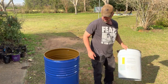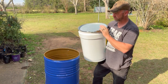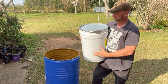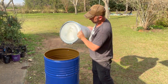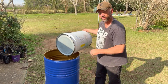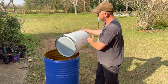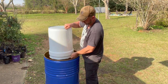When we put the inner bucket full of wood down inside the retort, we need a way for the gases to escape. We're going to drill some holes in the lid of the inner bucket so it off-gases out the bottom rather than allowing airflow up through it — because if air flows up through there, you risk lighting the material on fire. We want the material to stay smothered and off-gas through the bottom.